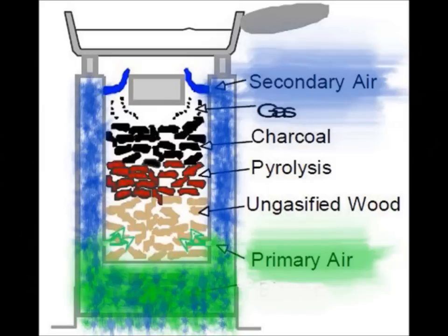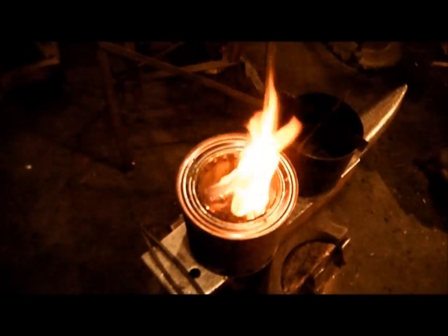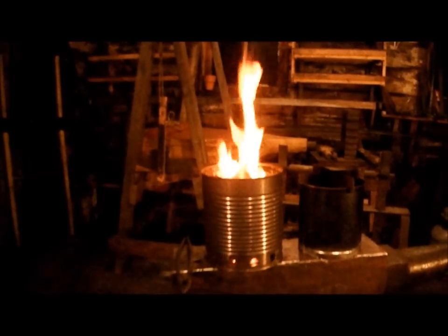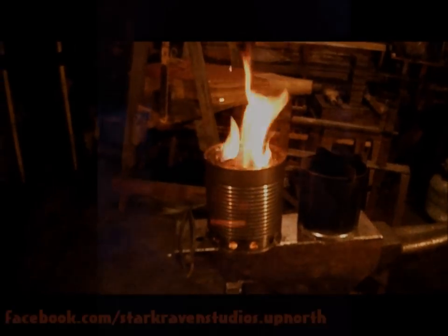So, here's how this system works. The goal is to separate the extraction of wood gas from its combustion. In a normal open fire, these two happen at the same time and in the same space. In a gasifier, primary and secondary combustion air are separated so that these two processes occur separately. The fire that starts the process at the top of the fuel chamber — the smaller barrel or can — heats the fuel sufficiently to release the combustible wood gas. This process is called pyrolysis, and it leaves behind unconsumed charcoal. Because there's not enough oxygen present in the fuel chamber, the charcoal remains unconsumed until the pyrolysis front reaches the bottom of the fuel chamber, where the incoming primary air would provide the oxygen to consume the remaining charcoal if the process were not shut down at that point. And that's the glow I look for at the bottom of the barrel through the window in the outside barrel of my charcoal kiln.